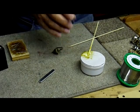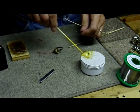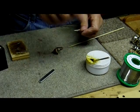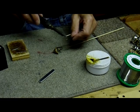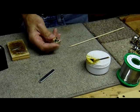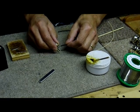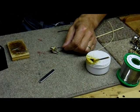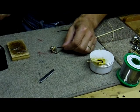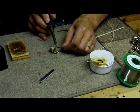Now we take the leads that are going to go onto here. This is cloth-covered push-back wire. I'm going to do the same thing — flux each terminal end, and tin them with a little bit of solder. So now both units have been tinned, and black goes to the ground side. I'll simply put that into the hole, and you can add some more flux in here — it doesn't hurt, it's going to make it go that much faster. Put a little bit of solder on the tip of my iron and just touch it to it.